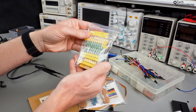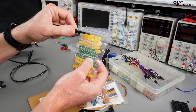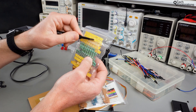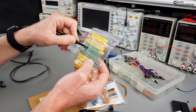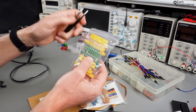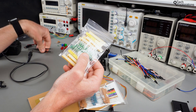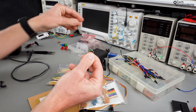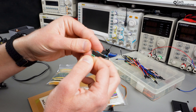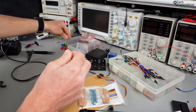You're also going to need inductors. Inductors are like coils, and we'll have some experiments with them. Just like with capacitors and resistors, the values of the inductors are marked on the package, which is even more important here because it's not easy to experimentally measure the value of an inductor — you'd need a special instrument. Also be careful: an inductor is similar in shape to a resistor. Inductors tend to be green and much larger in diameter, but they can confuse people.